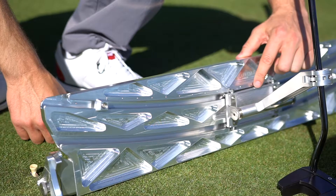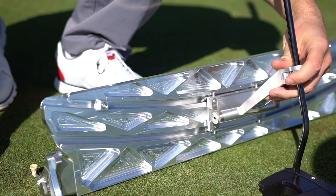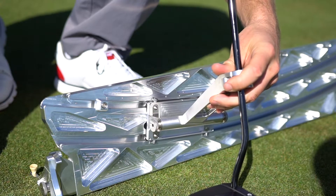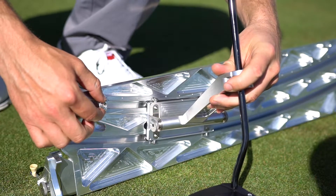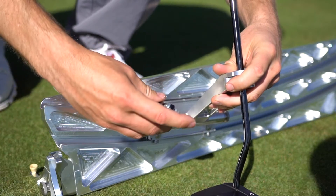In this example, we are setting up a 6-inch backstroke with a 3-inch forward stroke. Line up the center sight line with the carriage to the 6-inch marking. Now slide in the carriage stopper and tighten it down with the hex key.